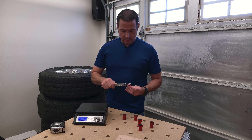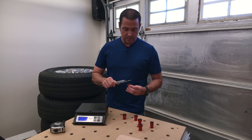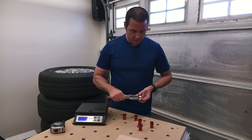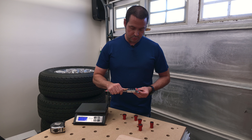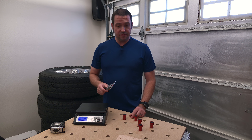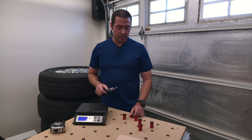Let me check the other ones — 27.68, so it's pretty consistent. The height of the dog that would protrude up on the milled part is 10.05 millimeters, and then the rubber is roughly 11 millimeters. So they will stick up just high enough — it'll be below your half-inch plywood and your three-quarter-inch plywood.